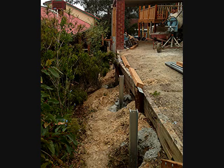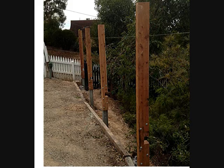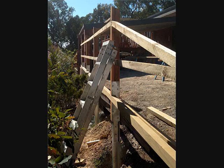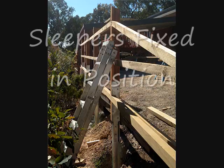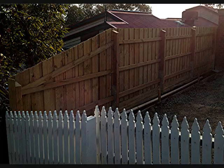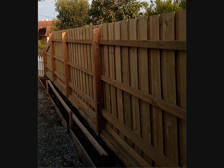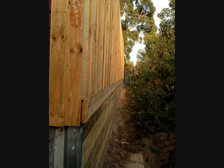In this particular project we had two sections along a side boundary fence starting at the front. We erected the UC section posts, pre-made our residential fence post on the bracket, and then bolted the brackets to the UC section posts. Subsequently we erected the residential fence for this part and backfilled to create a good look.